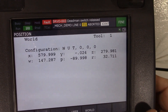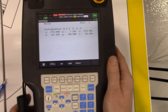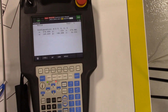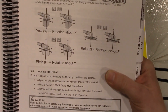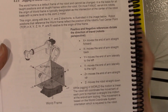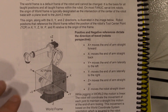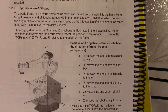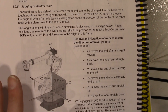It's showing me dimensions in millimeters — 580-ish millimeters on the X axis. There are some fantastic resources for you guys: this is the Handling Tool and Operations Manual, which you can find a few copies of in the lab. It talks a little bit about jogging in world frame mode. We draw a line through the robot base to figure out where these things are located. It says that the intersection of the joint two motor — if we find joint two motor on the robot and draw a theoretical line through it, that's going to be the location of these different measurements.